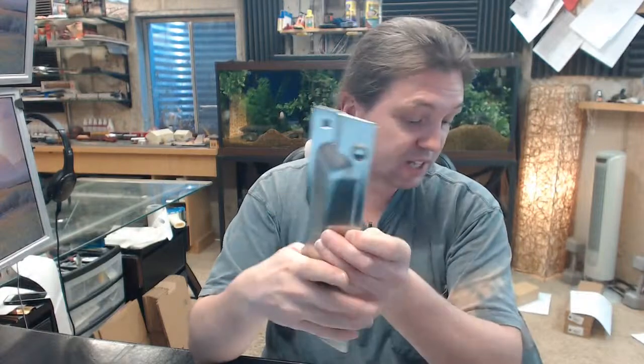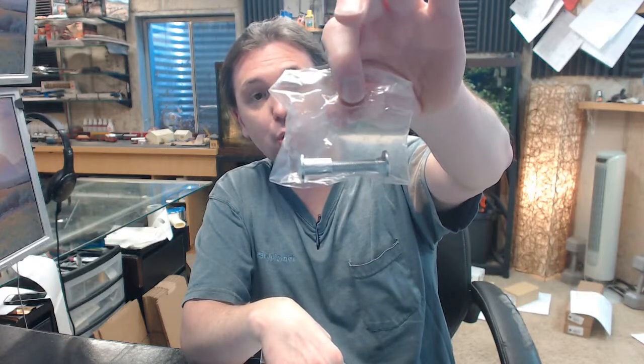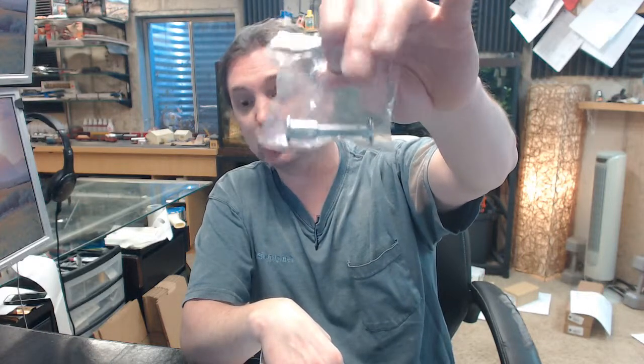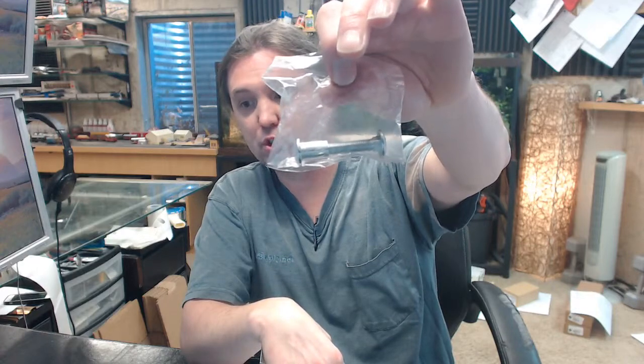The rest of the installation instructions we have already covered in the last couple of minutes. The rest of the extended description of this item is also already covered by everything that I've discussed here. Non-handed, frame prevents prying of door. It's used on 1 3/4 doors, and that's because of the bolt package that you have. Should your door thickness be unusual, you'll just need to swap that 5/16 carriage bolt out. Okay, that is what you'll end up having to do.